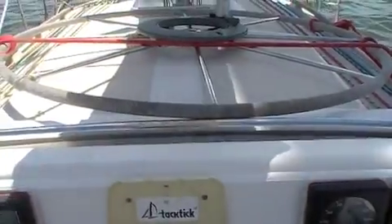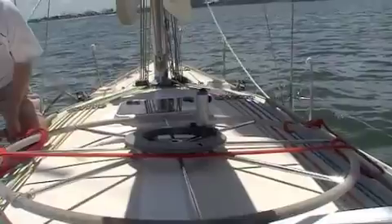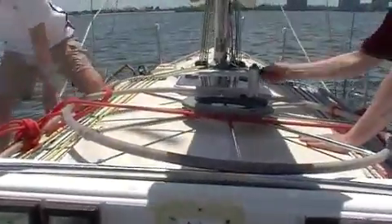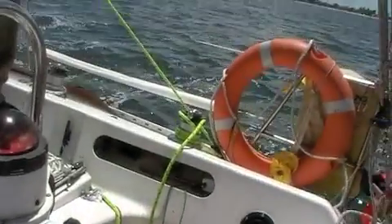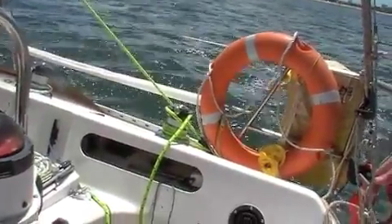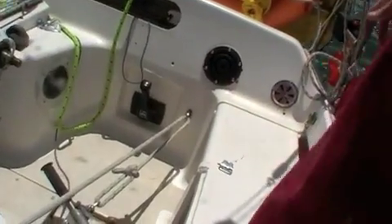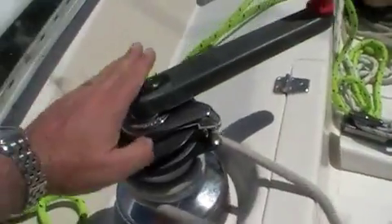The wheel is being lashed down — happy with that, it's not going anywhere. We haven't lost the key — Tony's got the key. We've put it straight across the top of the cabin, tied onto the two handrails, and for extra security we've put the weather cap over the electrical connector. We've now set up the steering ropes on the emergency tiller, using the winch here. We've run through the saddle down there, the cleat on the saddle, back up across here, onto this winch, and back down to the tiller — using this winch to control the rope.